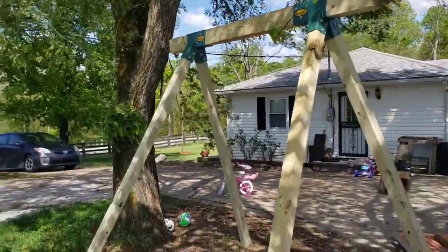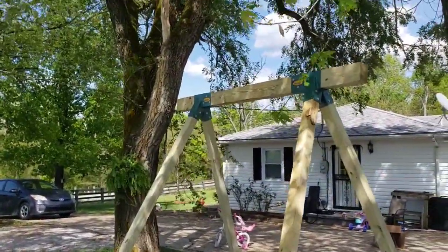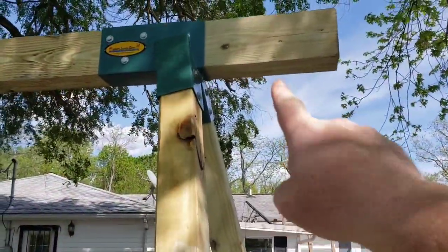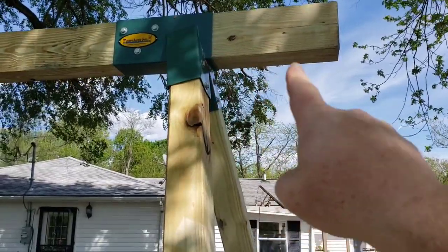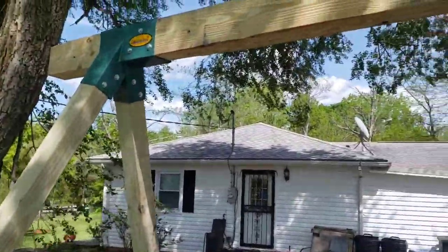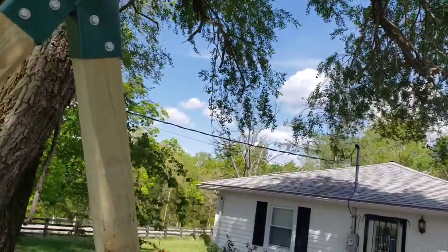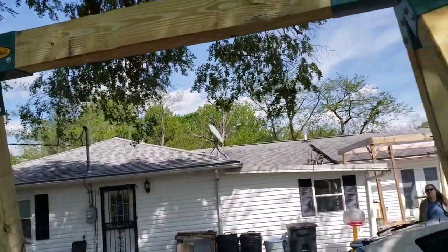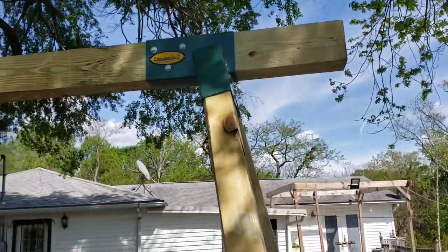All right, well there we have it standing up. Still got to put the structures on for the swing — that's a whole different part; this is about the brackets. There is going to be more than enough room here. I did 14 inches from edge to edge of the bracket, and with the way it's shaped that's going to be more than enough room. For a swing I really don't think it's too high with the eight-foot legs. Overall it's sitting at about six and a half feet in the air — not too bad. You could do it a little lower, but I want these high so there's no hitting your head.